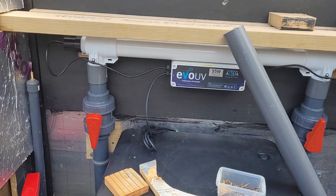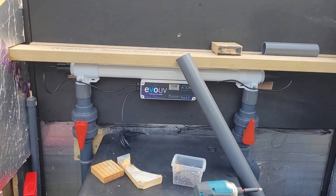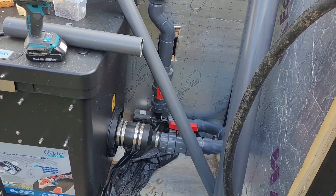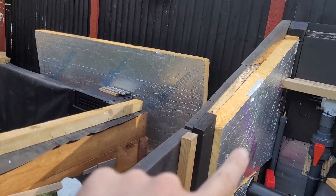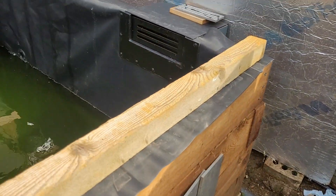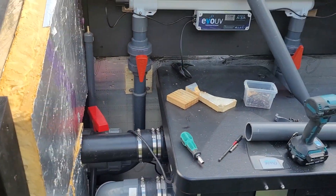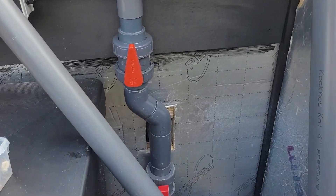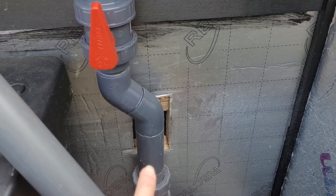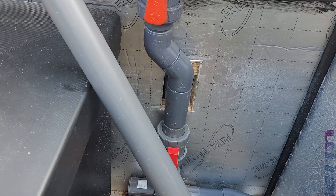Just twist a ball valve, change the UV. It's a 10 minute job to have the pump off and the filters off for 10 minutes — ain't going to hurt. That is now all the pipework done other than connecting the flexi hose. One to that inlet and one for the shower up there. I've got a ball valve on the end of that one to isolate the pump, because there's a T going out there — that's why I've got two ball valves on that line so I don't get any back flow if I need to take the pump off.